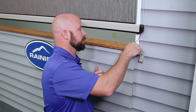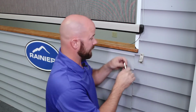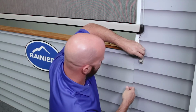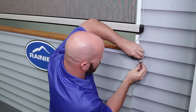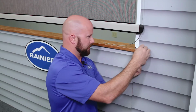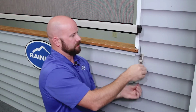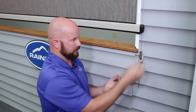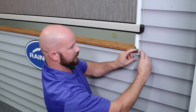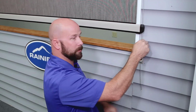And then what you're going to do is take your tensioner and you can put that into your bracket. You can notice on our system it's flat on 2 edges, and the bracket also has that, so you don't need 2 wrenches to tighten, which is kind of nice. It just slides in there and then it won't turn. So you're going to just put this nut on there, loose like that for now. And then this catch nut here, I loosen that as far as I can, so that I can feed the cable down through. This is a one-way cable catch. So you're going to feed that cable down through and hold that up as high as you can. And it's holding. You can see I can't pull that cable back out right now unless I press down on this to release it. Then I can pull that cable up all I want. As I let go of that, it grabs it and won't pull back out.